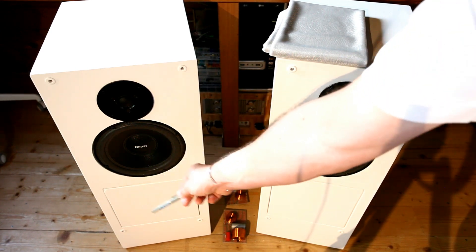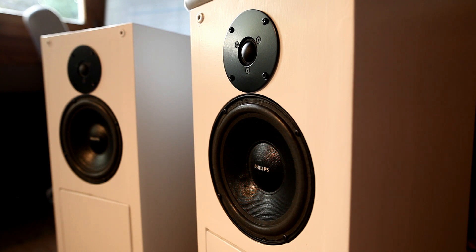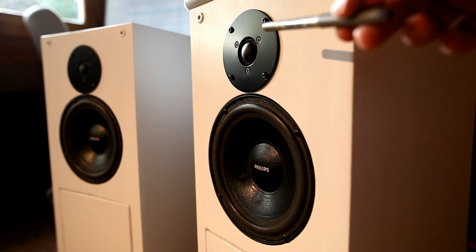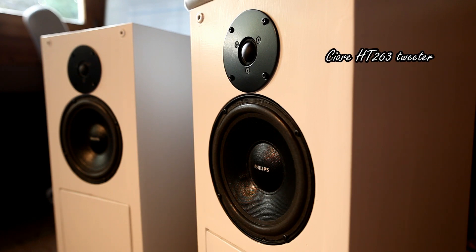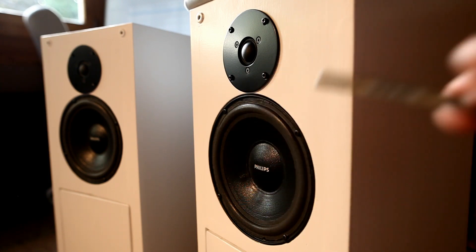Just one mention — this is a removable cover which I will utilize in order to work on the crossover, as I expect some fine tunings on the crossover will be needed. Here you can see a little bit more detail on the two loudspeakers I have deployed. This is a Siare tweeter, an eight-ohm component, and this is a vintage eight-inch Philips woofer where I replaced the foam surround.